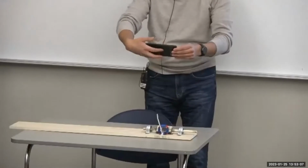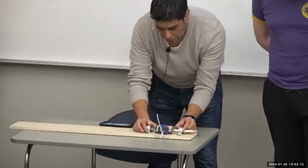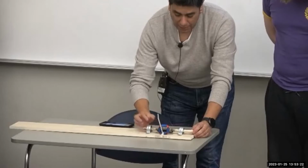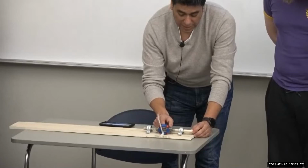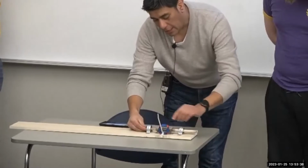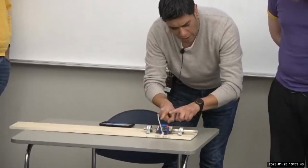So what you see here is very simple. We built this with a science student from the University High School. And basically, we have a rod here in which I attach two permanent magnets. So here will work as one as a north pole and the other south. So from the north pole, you will have magnetic flux that is leaving, and that magnetic flux will return from the south. And next to this, I put a wire, turn 400, this is like 200 times, I think.